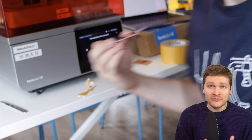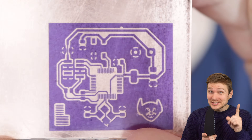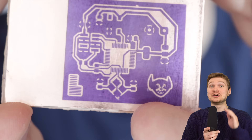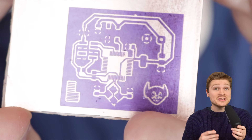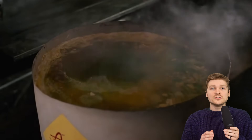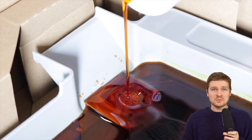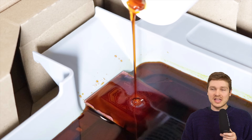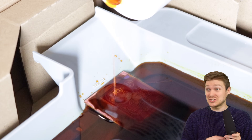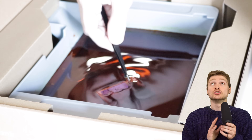The next time I tried it I only cured it twice, and that was perfect. When scrubbing off the uncured film in cold water with some borax, everything stayed on except for one loose STM32 leg pad that wasn't connected to anything else, so it didn't matter. Then I etched it using ferric chloride - which is basically the real-life equivalent of the Dip from Who Framed Roger Rabbit. It is the most evil stuff. Please dispose of it properly through your municipality - do not put it down your drain.